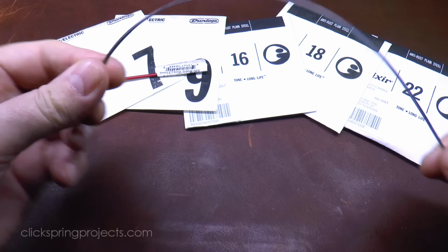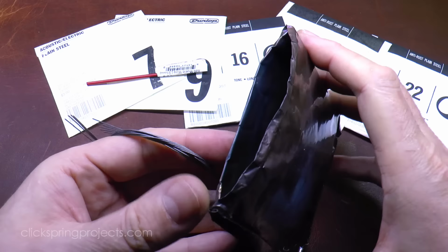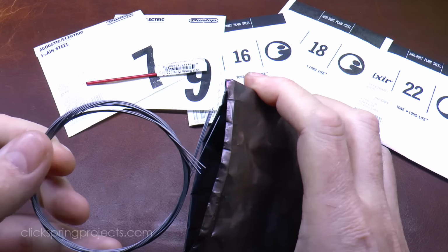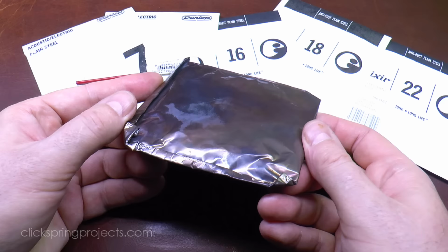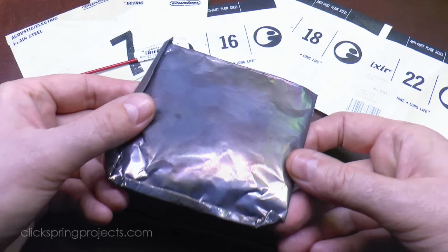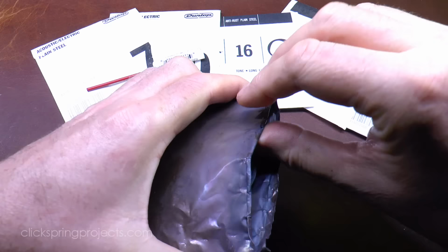Although as supplied, it has a spring temper, which is too hard for rolling. So it first needs to be annealed by heating to a cherry red colour and then being allowed to slowly cool. After this, the wire is dead soft and ready to be rolled flat.